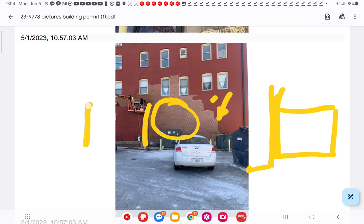We also have that brick, a new brick over there. It's not going to expand and contract as the other one. I'm just saying that's a factor, all right? The expansion and contraction of the building over many years. They do have many elevation changes, like windows. So here's this one, this one's down, these two are up. So you get many elevation changes, which gives you these very different panels on the wall, especially if you're trying to control expansion and contraction.